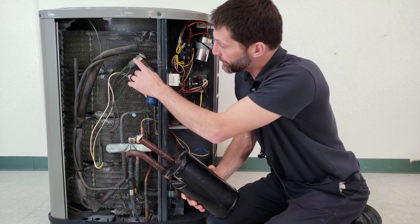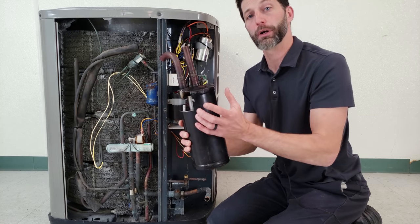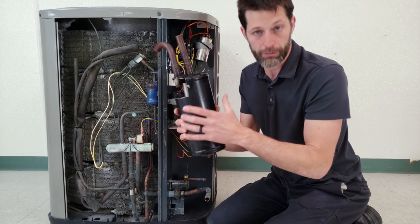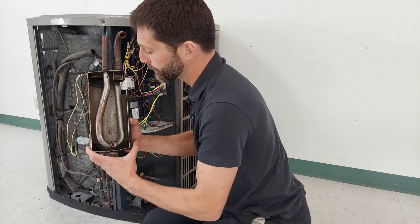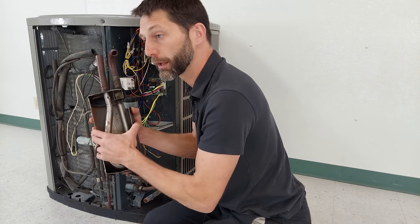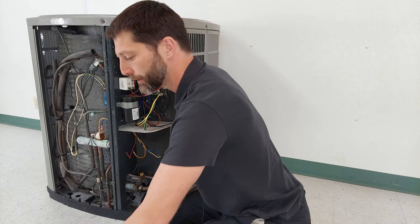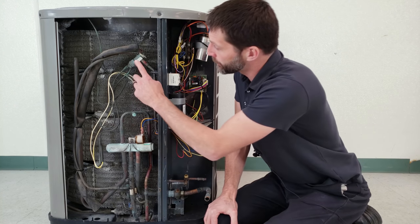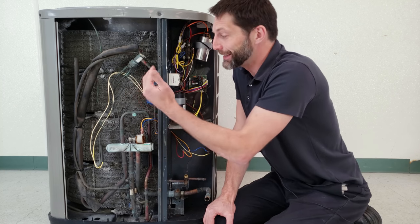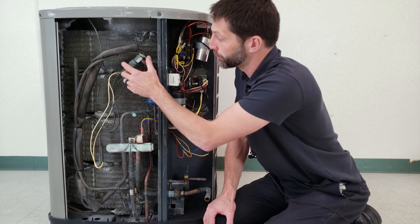In the case of a TXV you typically don't have an accumulator like this — a lot of times you'll see this right next to your compressor on the inside. This is typically matched with a piston or fixed orifice metering device that's only active during heating mode. The accumulator is there as an area to store refrigerant and to protect the compressor from liquid refrigerant entering it — it can only allow vapor refrigerant to enter. If you want to learn more about the accumulator, check out the video in the description below. Our TXV is able to handle the superheat, and if it can handle the superheat, it knows it's only allowing vapor refrigerant to the compressor — but only to a certain extent.